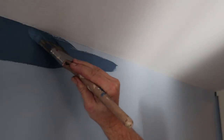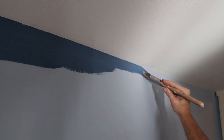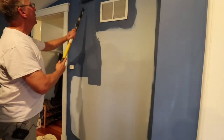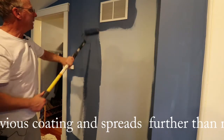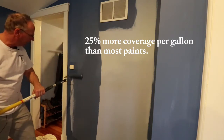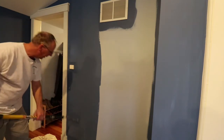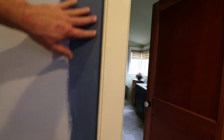I like the way it spread. It had good workability — I could get about 24 to 30 inches out of one dip of a brush, and about 27 square feet out of rolling. The can says it gets between 400 and 450 square feet per gallon, while the industry standard is about 300 to 350. That extra 100 square feet is a 25% increase, so even though the paint is a little more expensive, it goes a lot further, reducing the overall cost. This paint covers very easily in two coats, even for an amateur painter.